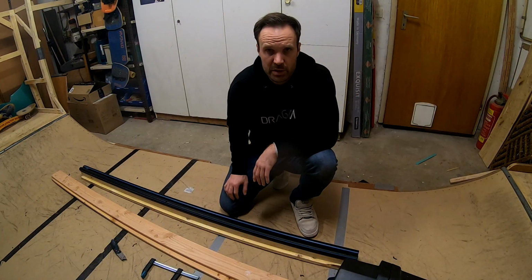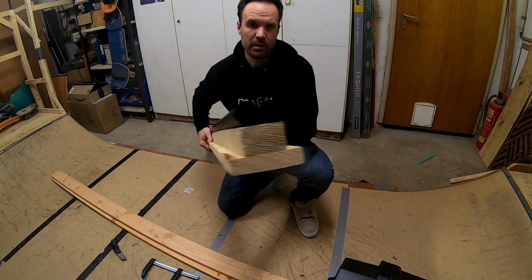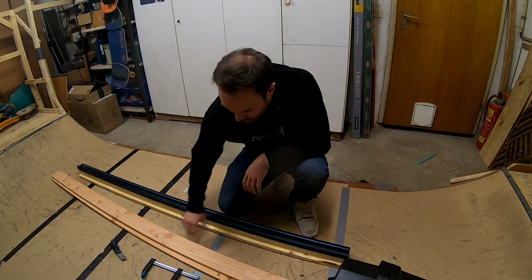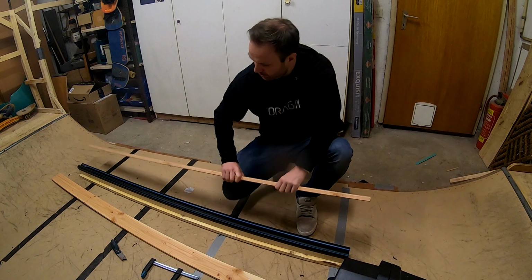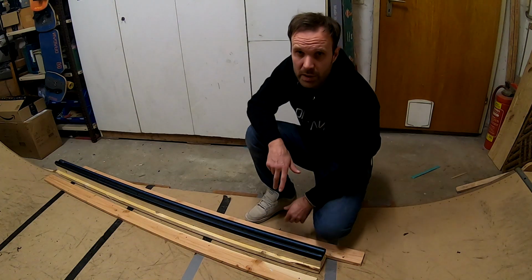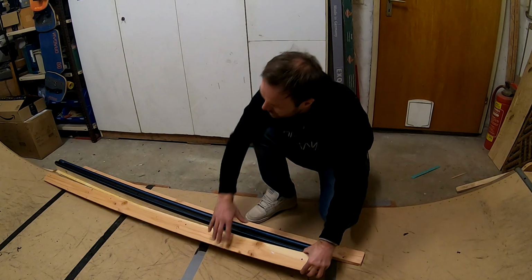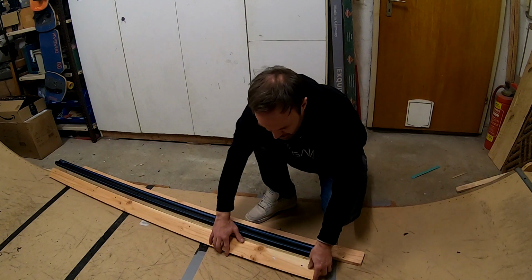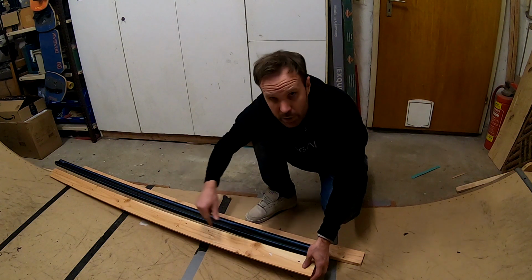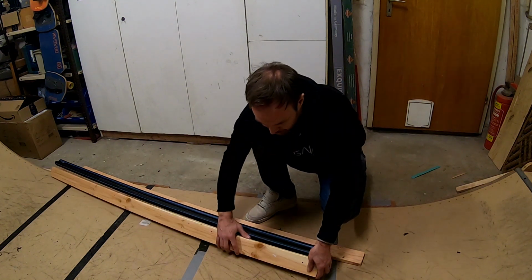After we mounted the PVC pipes on top of our base structure, your build should look something like that. We are almost ready to go. One thing to do is step 3, adding up the side covers for more stability and a better look. Also, the last step is quite easy. All you have to do is to screw the wooden plank sideways to your rail. But be careful, maybe you need to pre-drill some holes in the wooden plank in order to avoid cracks when screwing, but that depends on the wood you're using.